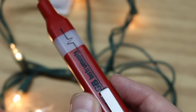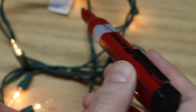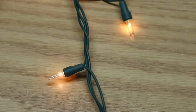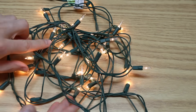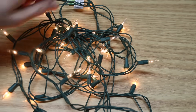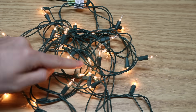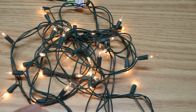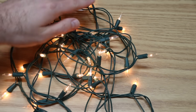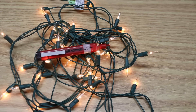Using one of these non-contact AC voltage detectors can help you quickly get through a strand of lights. If you have a lot of lights and don't want to go one by one, you can try going to the first one, then the last one, then halfway in between. Depending on whether you detect contact or not, go halfway each time to narrow it down much more quickly. I have a few more strings of lights to check, so I'm definitely going to take this shortcut.